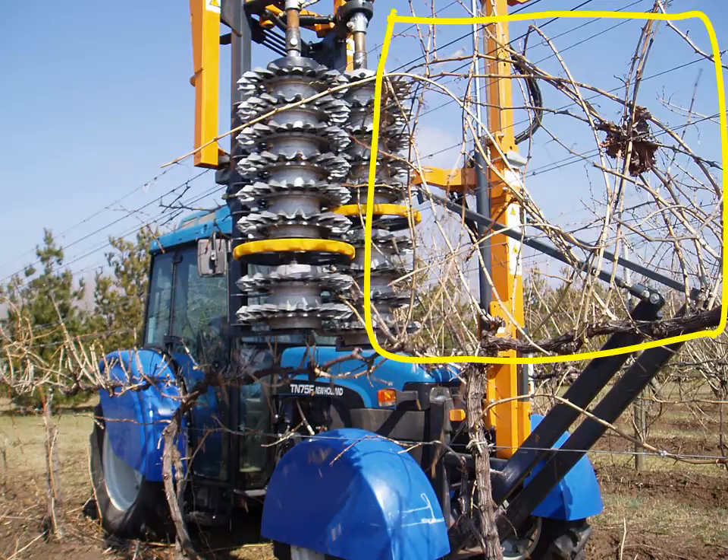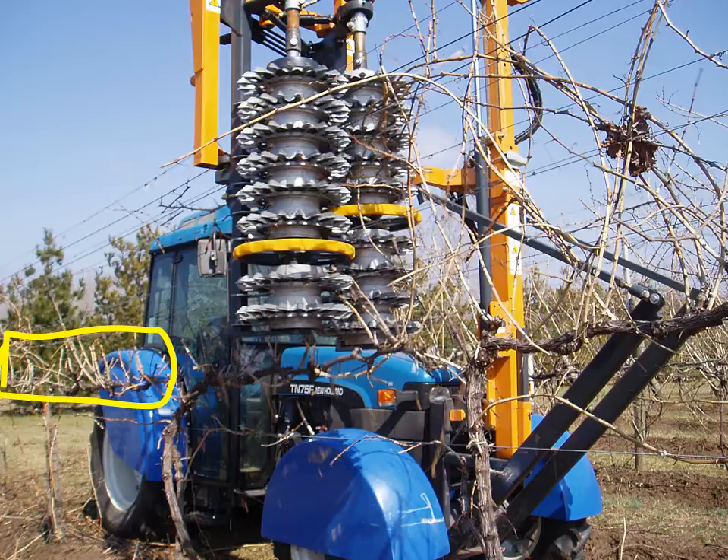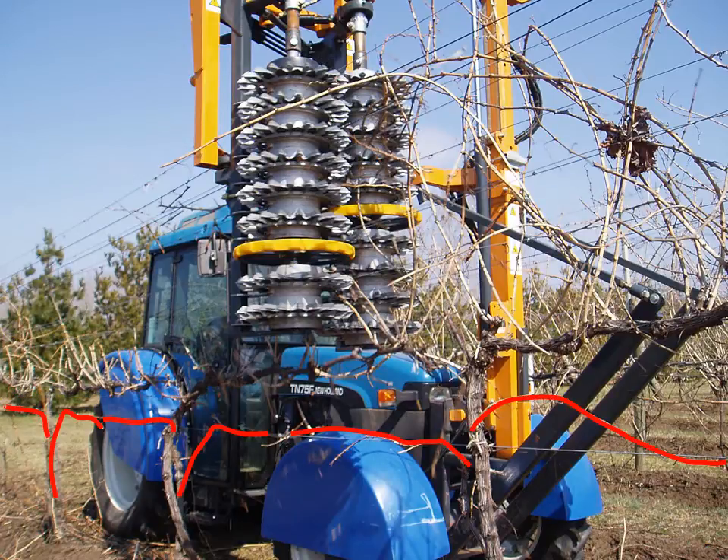The target is to take those canes above the upper fruiting wire and prune them off — it cuts these canes into about three-inch length pieces that fall to the ground, creating a pruned area on the upper fruiting zone. Before the machine went through, we had to take care of the canes that form the lower fruiting wire. If we hadn't done that pre-pruning step manually, we might have pruned some of them off and they wouldn't be available.